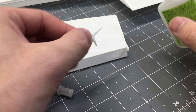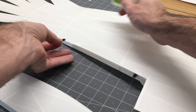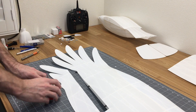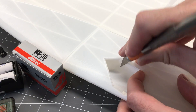The ailerons are printed out of lightweight PLA, so they use a PLA control horn glued next to the lightweight PLA to make it a little stronger. We'll go ahead and glue the TPU hinges in place — just use a little dab of CA glue to insert those TPU hinges. Before we glue the aileron in place, we're going to set up the servo and the push rod first.